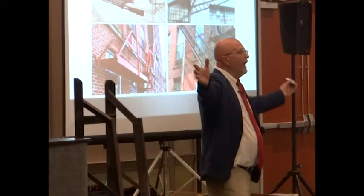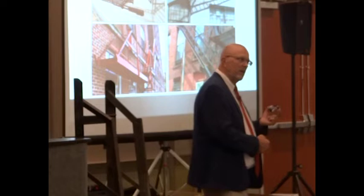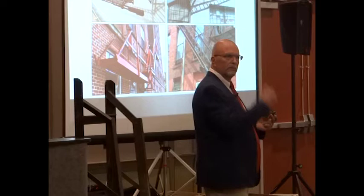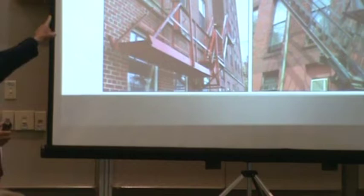Now what happens for that fireman that just put his foot on this cantilever that wants to throw itself back up? And there's more firemen arriving. So they've just lost one fireman, and what's he doing? He's a doorman now, he's a fire escape man. His job is to sit there, standing on this fire escape, while other firemen go up and down. So the fire department loses one guy. So cantilevers are supposed to drop 2 to 3 feet per second by themselves, hit the ground, stay down. That's why they call them balanced fire escapes. Questions?